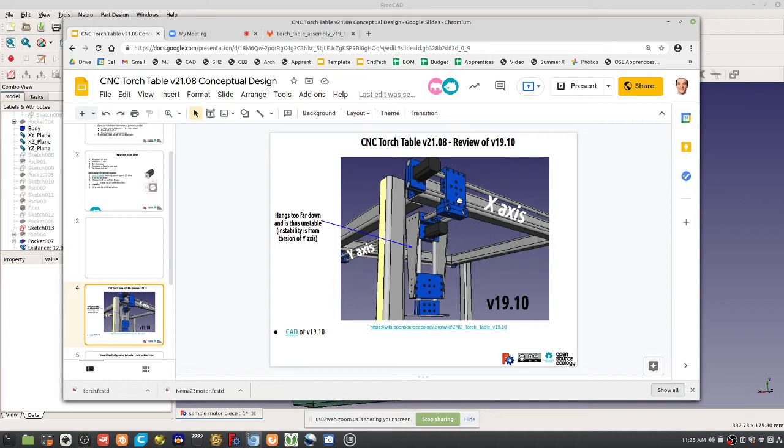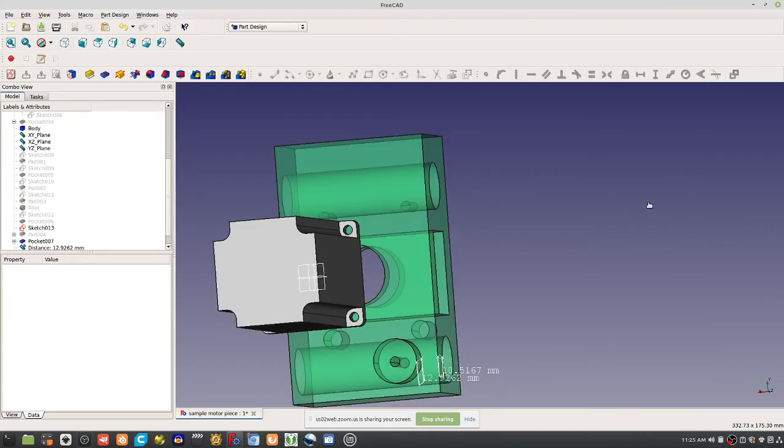Well, a quarter inch is going to be 1/16 of 50,000 psi. Steel is about 50,000 psi, so 1/16 of 50,000 is about 3,000. So a quarter inch bolt has about 3,000 pounds max before it shears. With a 10x safety factor, you've got 300 pounds. A quarter inch screw can very easily hold 300 pounds. Not a problem. Let's use quarter inch screws.